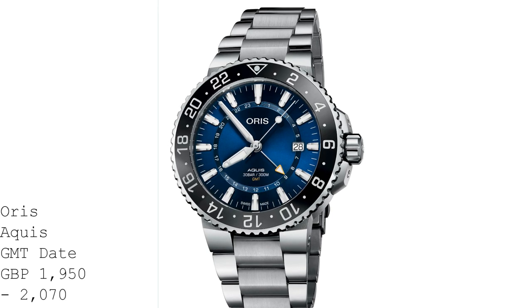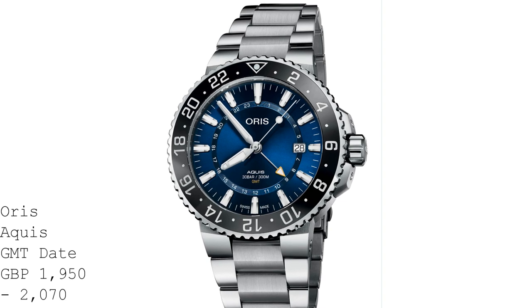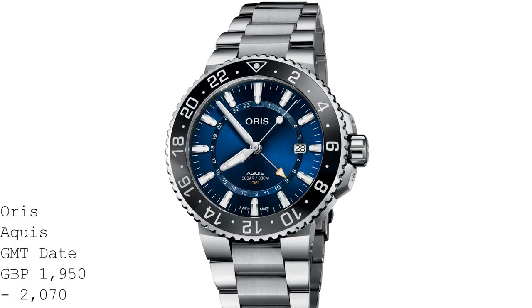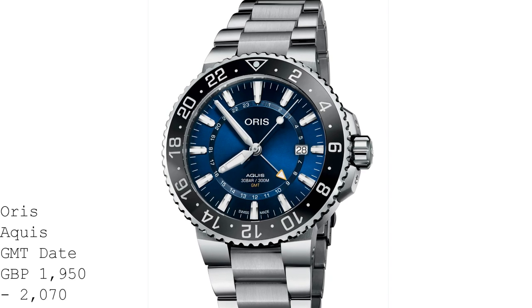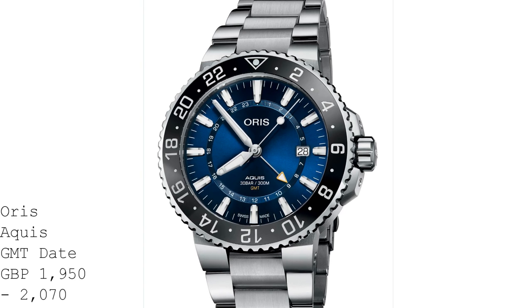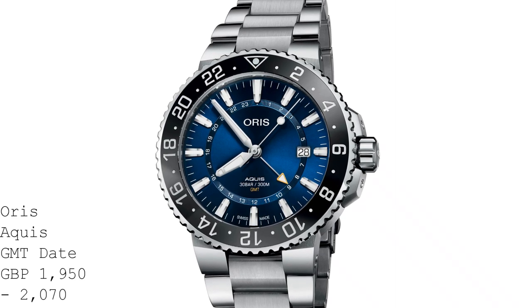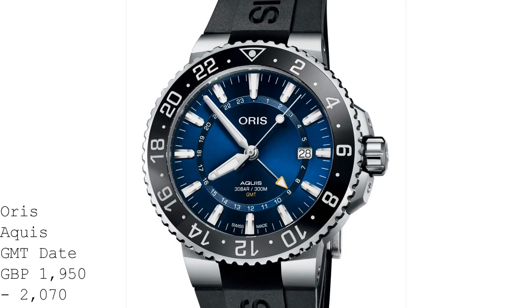Inside the watch beats a Sellita SW330, which is a similar architecture to the ETA 2892 series of movements, which in fact were developed further by Omega to produce some of their early coaxial movements, just adding a bit of history to this movement. However, this movement has been upgraded somewhat by Oris, and given the customary red rotor which is seen on their watches, in addition to its 25 jewels, hacking and hand winding, and of course its GMT function.